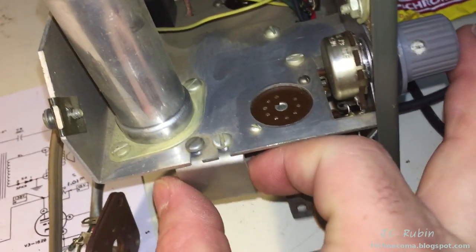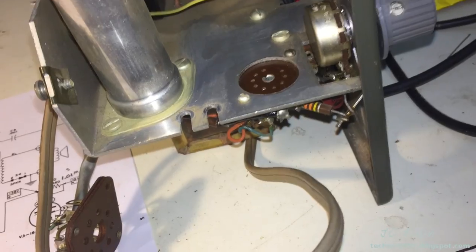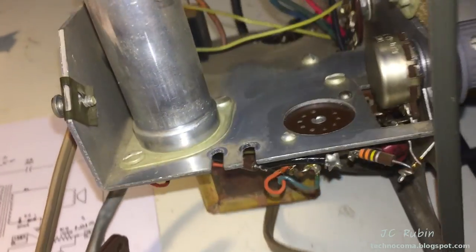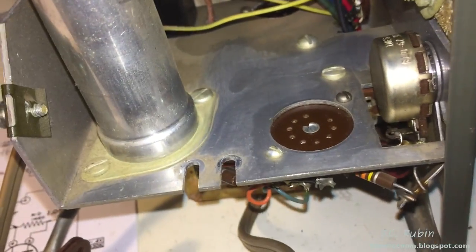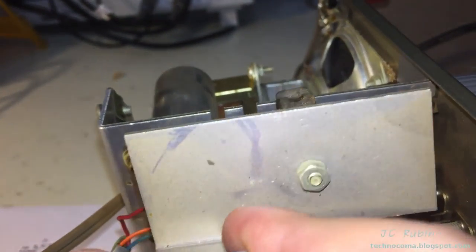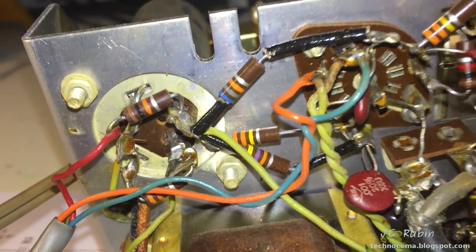The kit allows for two screws to be loosened to remove this area for more work to be done under here once the magic eye tube is removed. This will allow me to test the resistors under here that would not be easily accessible without doing so — that makes it a whole lot easier to test the resistors and circuitry under the 12AX7. This will also prove really convenient when it comes time to reform this capacitor — this whole area is now wide open, which is really nice.